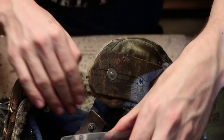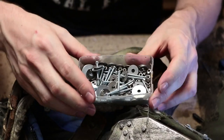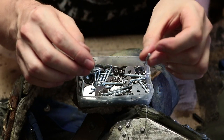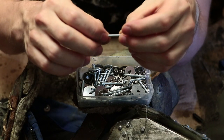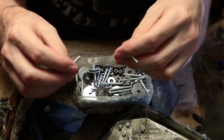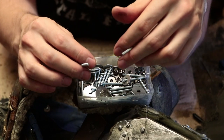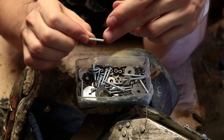Let's get to what kind of bolts I have here, and what kind of washers. In general, these are 3mm thick, or M3 in Germany. If you don't find 3mm exactly, you can take something similar. However, I would not recommend going below 3mm, not far below anyway, because in my opinion that becomes too thin.